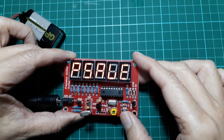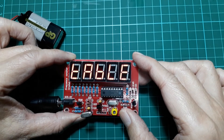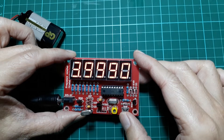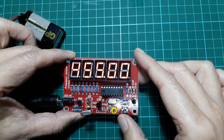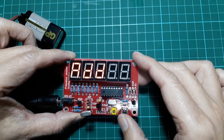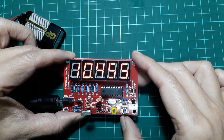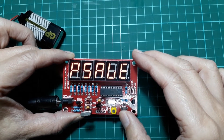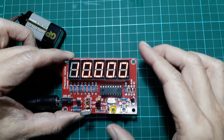For the table entry in the programming function, long pressing table brings up a list of pre-stored frequencies: 455 kHz, 3.999 MHz, 4.1894 MHz, 4.4 MHz, 10.7 MHz, then loops back to 455 kHz. Let's long press on 455 kHz, and it jumps back to the select menu. We do an add, and now it reads 10.455 MHz. To undo this, let's do back to zero, and now it reads 10 MHz again.